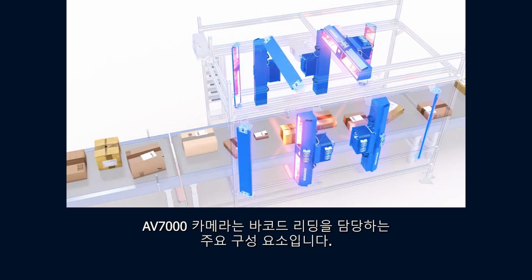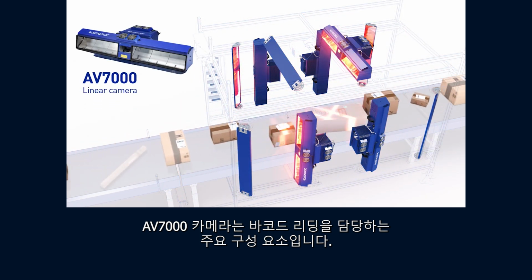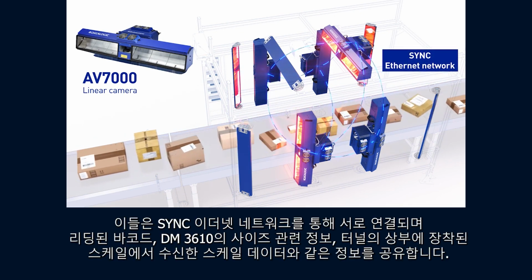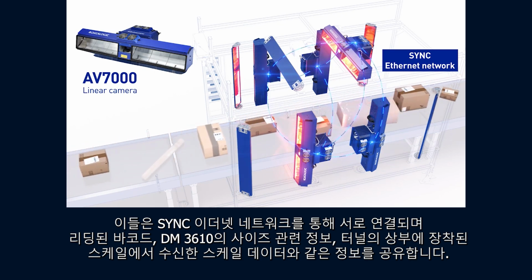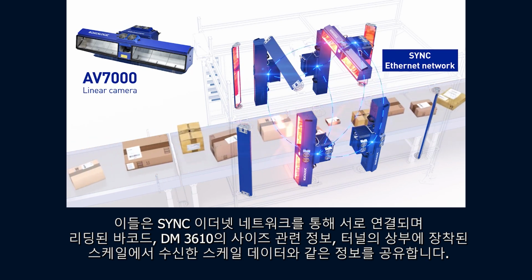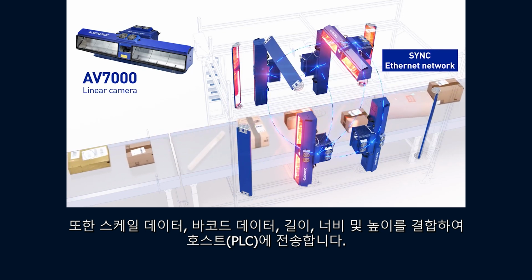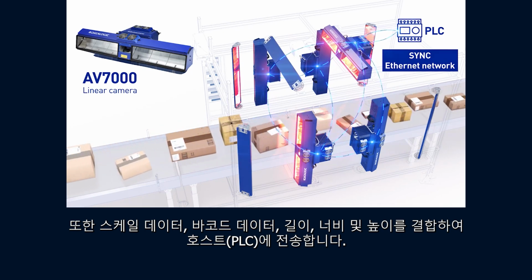The AV7000 cameras are the primary components responsible for reading barcodes. They are connected together by the SYNC Ethernet network and share information such as barcodes read, size messages from the DM3610, and scale data received from a scale mounted upstream from the tunnel. It also combines the scale data, barcode data, length, width, and height and transmits it to the PLC host.